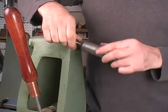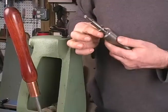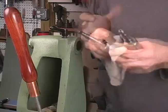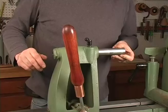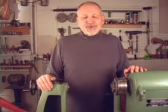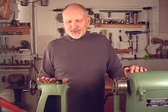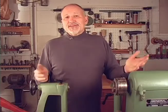If you notice a buildup of grease at the base of the quill where the screw enters, wipe off the excess grease. Since adding grease, I've never had to machine a new guide pin slot, purchase a new screw, or even replace the quill. As a side note, I wish lathe manufacturers would create some sort of grease chamber or oil bath in the tailstock to prevent this from happening.